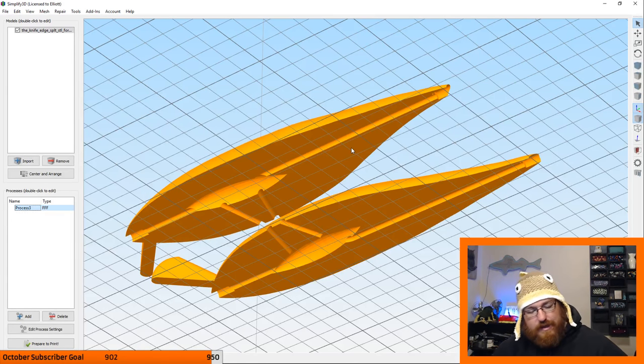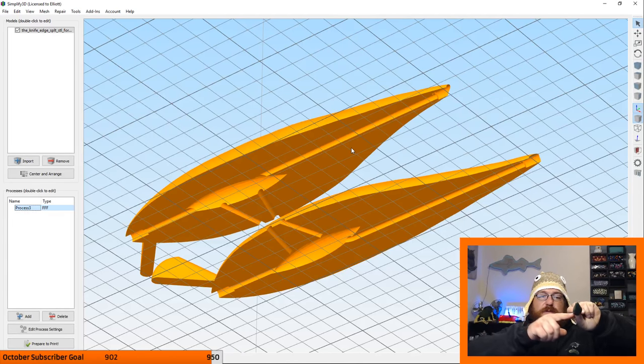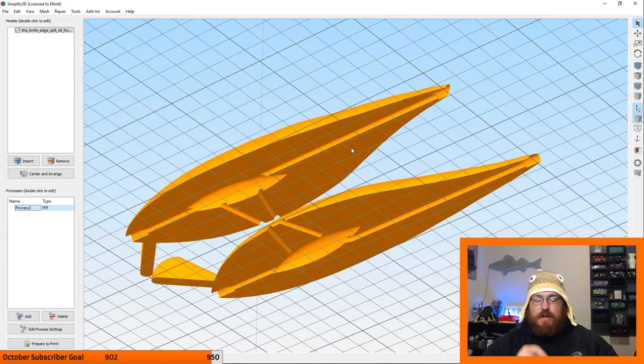The other thing I was thinking of is to model a through hole on each side. Then you just line it up and thread in an M3 with a recessed hole. Just thread an M3 on either side, and then they're locked together. You would only have to glue the bill together to keep it down. The problem with that is you kind of mess up some of your hydrodynamics on the side, because you'll have a dimple, and it's a whole big thing.